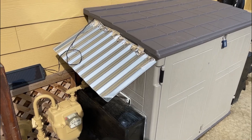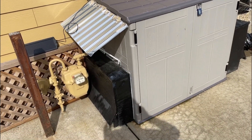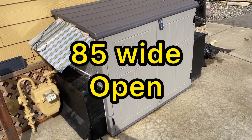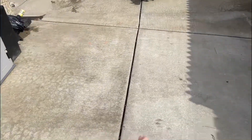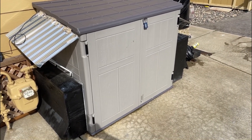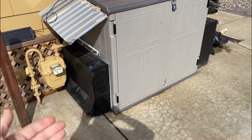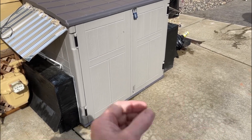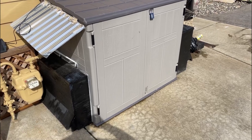What we can determine from this is that the ambient sound around here is about 50, roughly. The generator, unboxed and unmuffled, is about 85 at about 10 to 15 feet away. So with the box alone insulated, that cuts down about 10 decibels. Of course, you've got the intake and the outflow for the cooling also muffled — it's about 10 decibels.